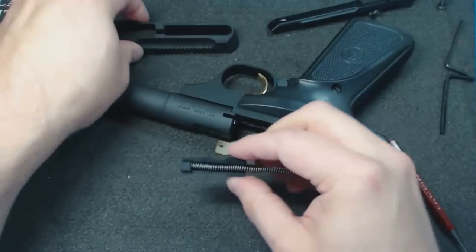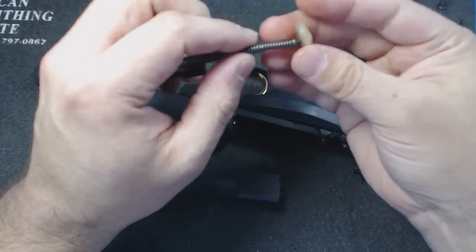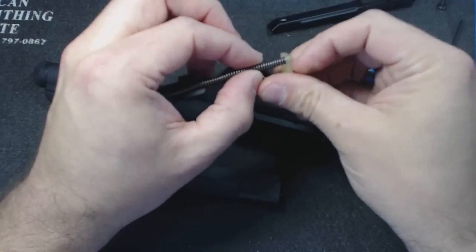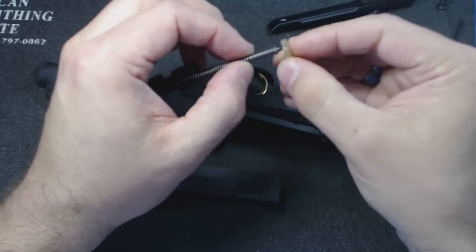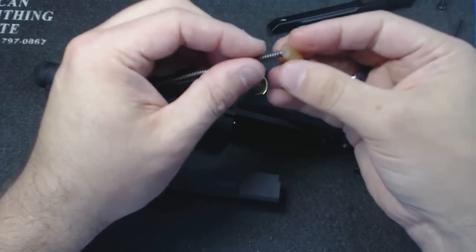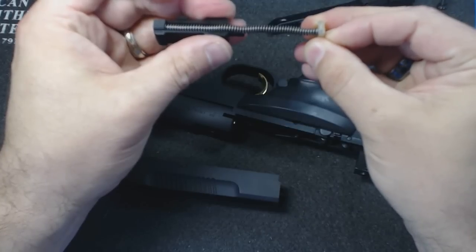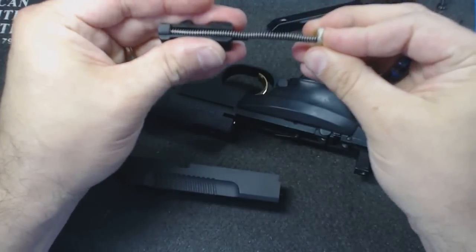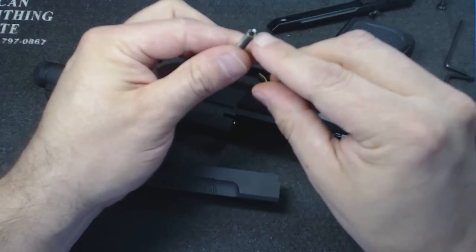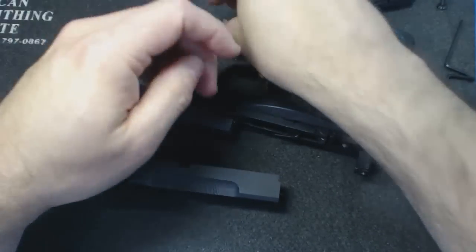It's really being, you know, the pin doesn't drift because it has nowhere in the body to drift. And again, this back plate, you know, it's got a concave shape where the end of it sits. And it doesn't actually bottom out on the plate itself. If you notice, that little pin goes past it. So this shouldn't wear out that fast, because it's not really absorbing that pressure. The back of the pin is really being stopped. It's mainly there to just buffer the spring and the retaining clip, so the retaining clip doesn't get worn out. So it really is kind of holding the clip in place.